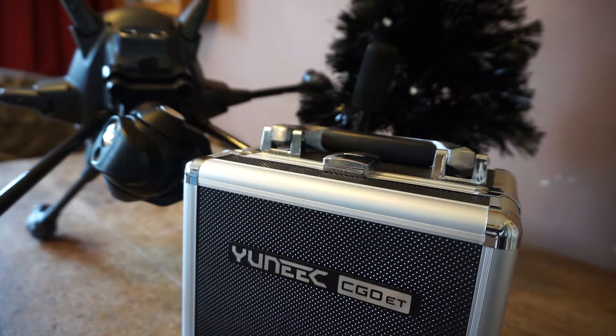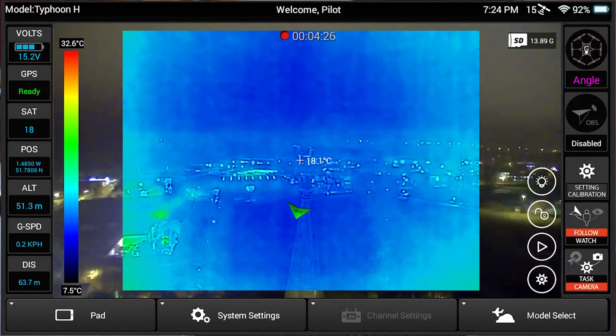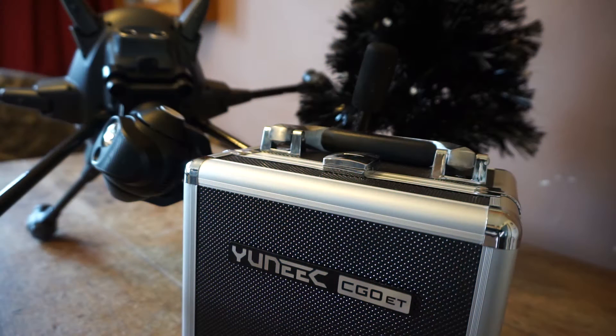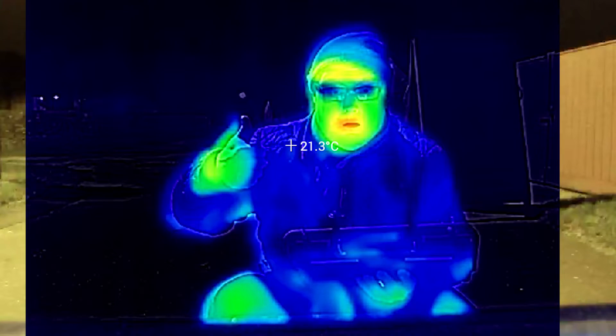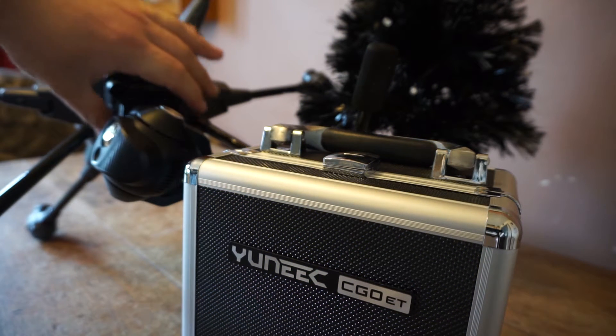It is a low-light 1080 combined and receivable picture-in-picture or superimposed camera with temperature measurement and display. You can have a multi-color spectrum which you can change to show different visualizations of heat sources, so it's very customizable. It's got different temperature detection scales for specific ranges — for example, if you're after body heat, there's no point going much more than 40 degrees C, whereas if you want to look for other things you can change the temperature scale.